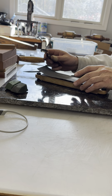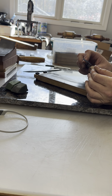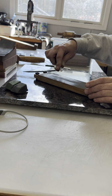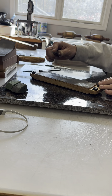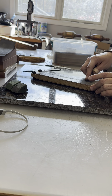There's no magical time when that transition takes place, but I would say certainly when you go to the strop, you're starting to hone. You've set your edge — you're just now polishing out the scratches. You're taking those scratches away and you'll feel that resistance change as well when you go to the strop. It'll even sound different, or at least it does to me over practice.